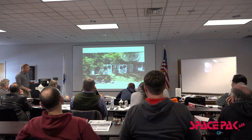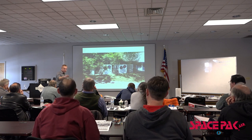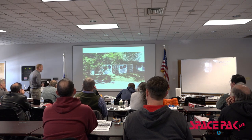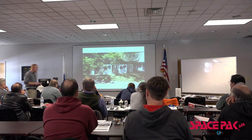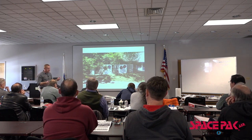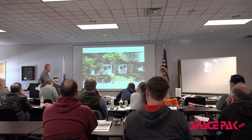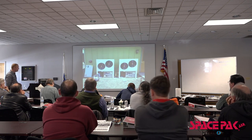This is actually Dick Wolf's house, the Law and Order franchise guy, yep. So this is his home. They had a different set of chillers in there that didn't work out, thank goodness, and brought ours in, went up there, did a little work on it, and now the system works quite fine. I had a little piping issue, a little return and supply was mixed up, but nevertheless, we took care of it. Had 4-inch copper header mains outside and all over the place. That's quite the job, to say the least.